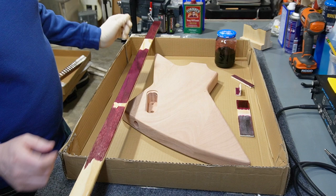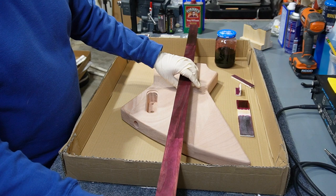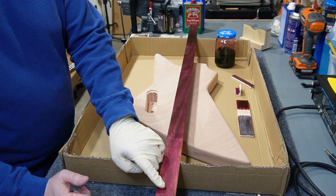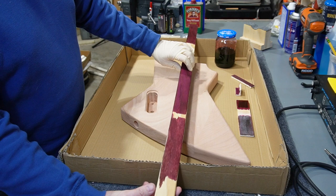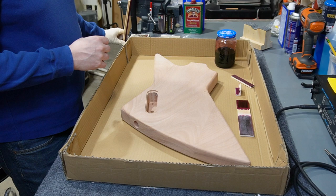This is the full-strength dye and I wasn't real happy with that. So I started playing around with dilution of the dye. On this stick here I've got full strength down to different levels of dilution and I didn't quite like this level of dilution either, so I've landed somewhere in the middle. I was also trying out some of this dye on a rough surface versus a smooth surface just to see if it made much difference - it doesn't.